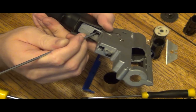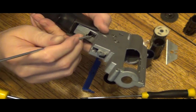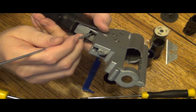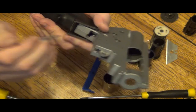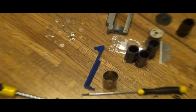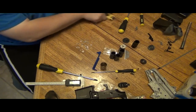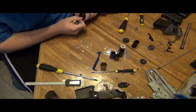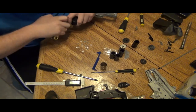So I'm going to put a 0.1 millimeter on the bottom of the bevel, and I'll push it up. See, there's a little bit of room here. Might be more than 0.1 millimeter, but we're going to push it up a little bit, and then we're going to have this kind of play, and that's the kind of play we're actually looking for. So that would be pretty much spot on. Let's zoom out and go ahead and do that then real quick. All right, so first thing is we undo the pistol grip. Go ahead and undo these real quick.